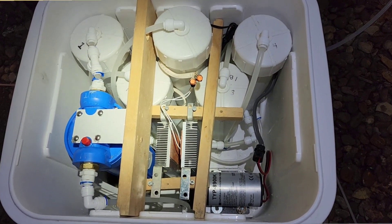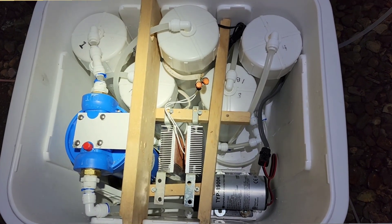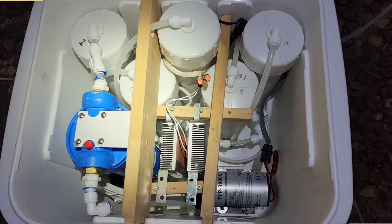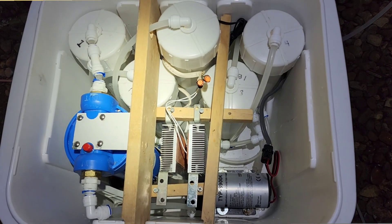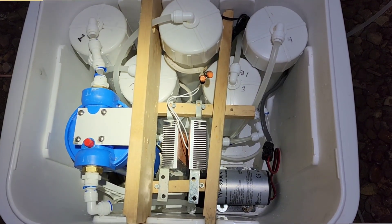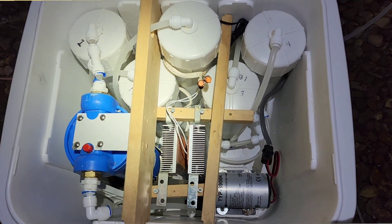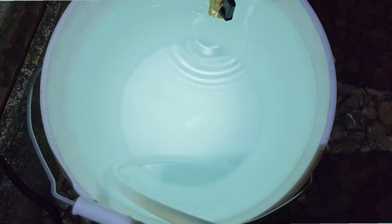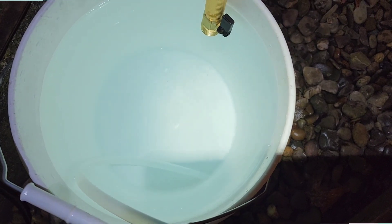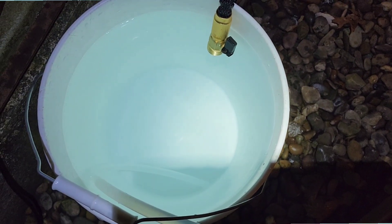This is our original RO unit and we're doing the flush with the carbon block filter in there. If we get a heavy run of sap we're going to use two ROs in parallel. We've got the first one running already and we're just flushing out new membranes from Membrane Solutions using that carbon block filter, with our municipal tap water that we previously tested. We'll run this for about an hour or a little more to make sure we've got everything flushed out — just filling a bucket with water and feeding it into the RO, keeping that at steady state for an hour, and we're all set for the season.